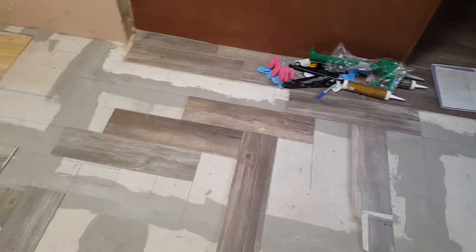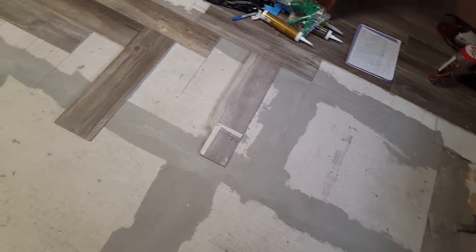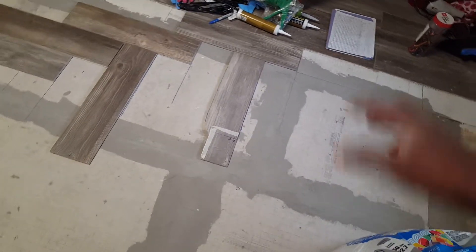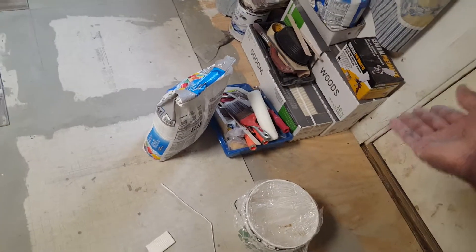It's weird because I need to make sure I can't start them going this way and then that way and run out of time. I have to finish sections because when the mortar dries you can pull tiles in particular directions, and I can't block them all off by screwing in wood — it's not practical. So I have to determine how many tiles I actually need. I'm pretty sure I need about six more boxes.